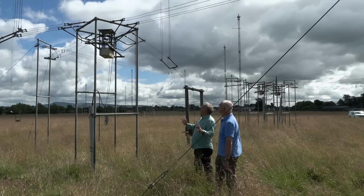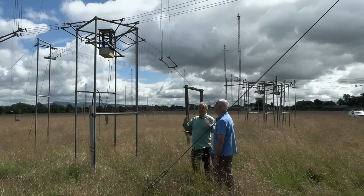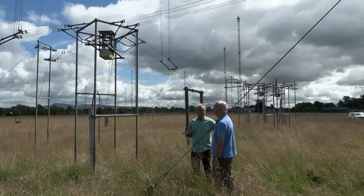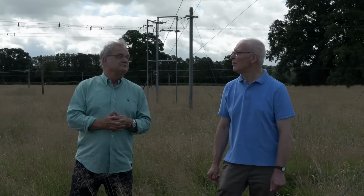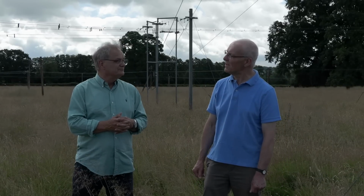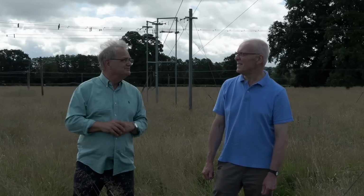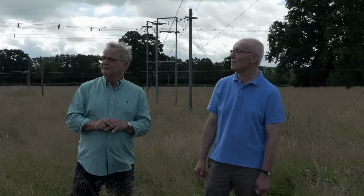So we've covered off how we can widen the beam, narrow the beam, slew the beam. When we get to this switcher, that's one last bit of magic you could work on this antenna. What does that do? This is the reversing switch, Bob. So this gives you the option to transmit on bore sight 114 or reverse bore sight 294. So if we're in the opposite direction, what's that way? You're into Central Southern America, Panama, Texas, that sort of area.